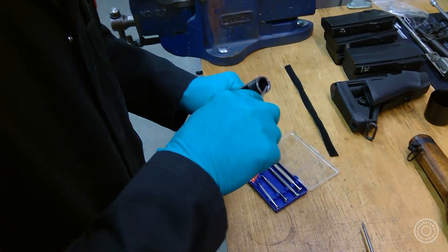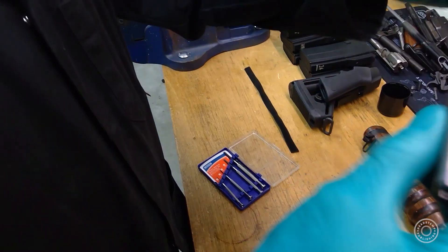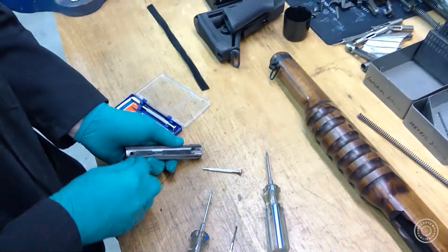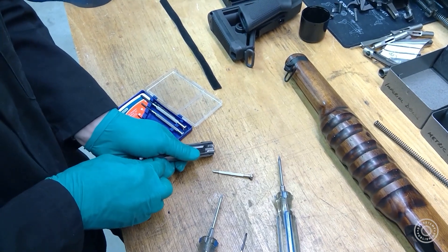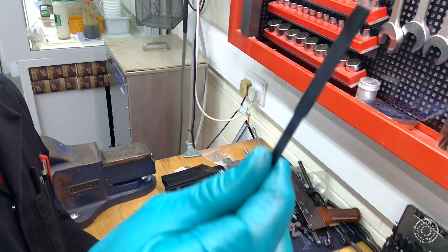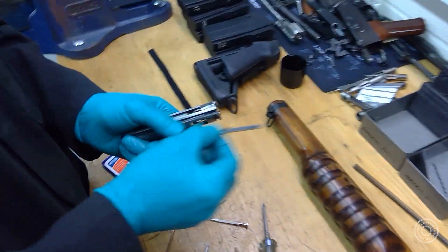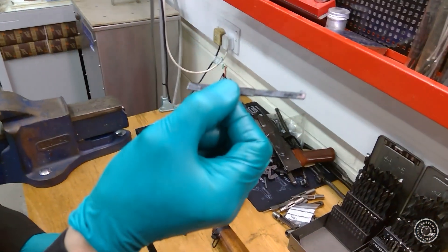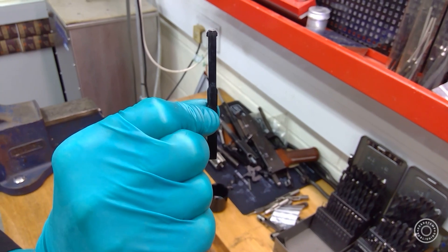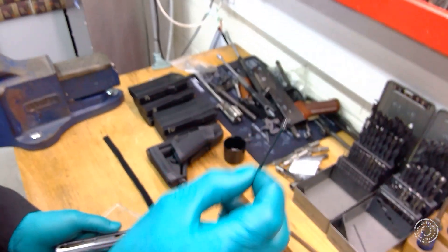Someone will edit this I'm sure. I haven't actually done any cleaning yet. Right, there we go — that's it above the sear. So that's the sear spring, which is the only one. I mean it's not just a straightforward flat spring — it's got a lug on the end. So even this single component is a complex thing to manufacture, and then of course to heat treat.